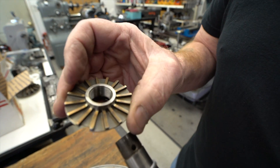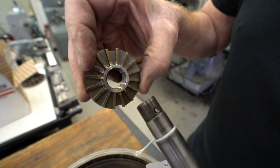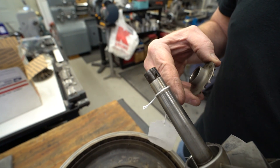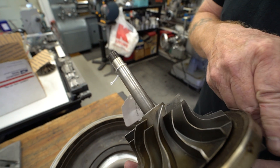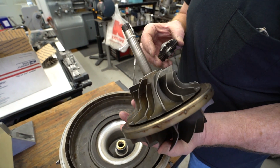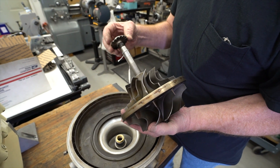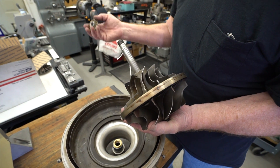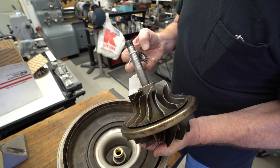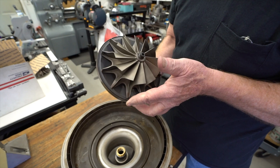It actually extracts oil. It goes on this way and the oil shoots up through the middle of the shaft, and the air from some of the compressor bleed comes out through some holes on the back here and it blows it back around the shaft and through the bearing and back into the gearbox. I've got a shaft that's removed and we can demonstrate that better in a minute. But this is how it looks coming out of the engine.